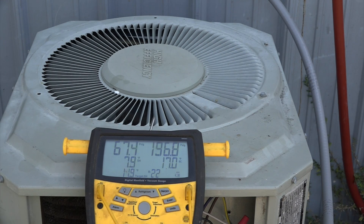You can see we've actually gone a little bit too far — it'll probably do that because it doesn't balance out right away. The superheat has actually gone down a little bit too much and now it's coming back up again. Anyway, make sure that your coils are clean before you try to charge one of these things on a fixed orifice — it's especially bad.